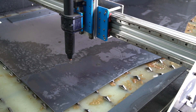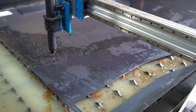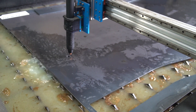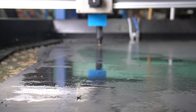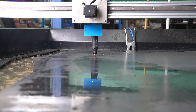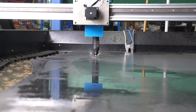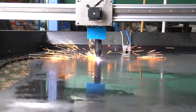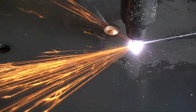You don't have to build one of these with a waterbed, but there are some significant advantages. Number one: improved cut quality — the waterbed helps to cool the metal being cut, reducing heat-affected zones and warping, resulting in improved cutting quality and accuracy. Number two: increased lifespan of the plasma torch — the waterbed helps to dissipate heat away from the plasma torch. Number three, a major one for us: enhanced safety — a waterbed can reduce the risk of fire or explosion by cooling hot metal, as well as reducing exposure to harmful chemicals and fumes like mill scale. Number four: improved cutting speed — the waterbed can increase cutting speed by reducing the amount of heat generated during the cutting process.